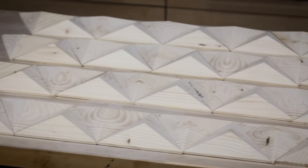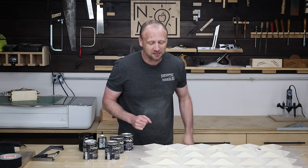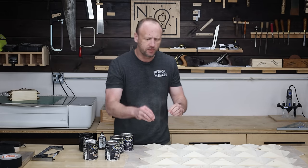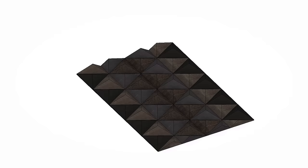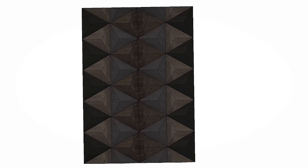I cut all my triangles — they look great. That was a whole lot of bevels and it took a long time, but they're finally done. I sanded everything with 180 grit. Now the plan is to take some stains and stain them in different colors, all in a cool family of colors. I think that's going to give it some awesome visual elements with all those bevels.